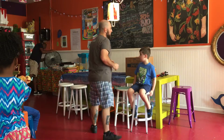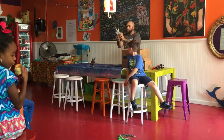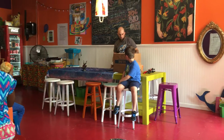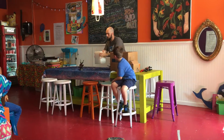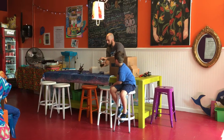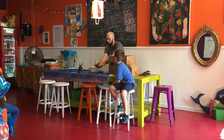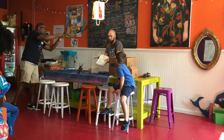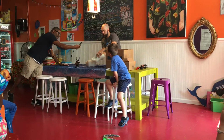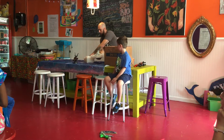So what I did was I sculpted the original piece here, and then from here, I got silicone to make a silicone mold, which I'm not going to show you the mold making process today because that takes a little too long. But basically I laid this down in a box, and I filled it up with liquid silicone, which over a couple of hours hardened up to get this piece. And in here are all the details. You can see how it fits directly inside. And once that was done, I sprayed it with this coating so it wouldn't stick, and I poured the top half.